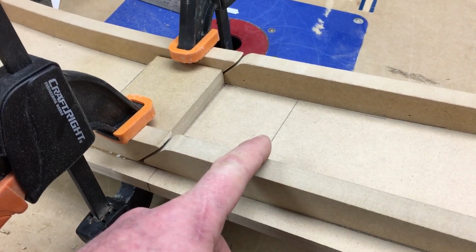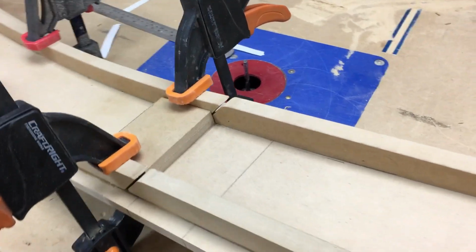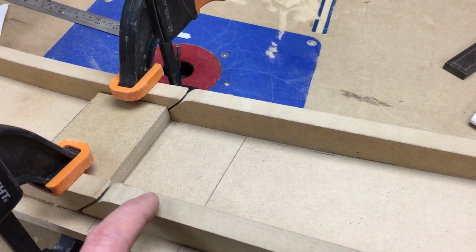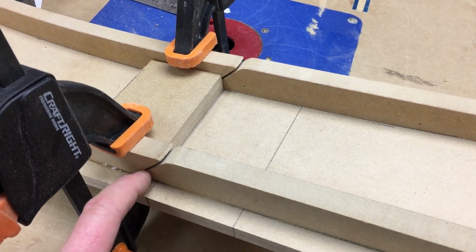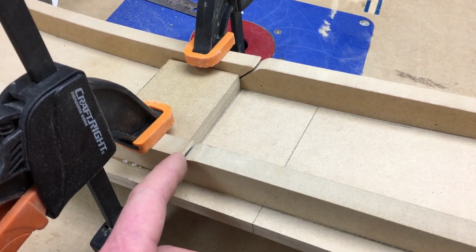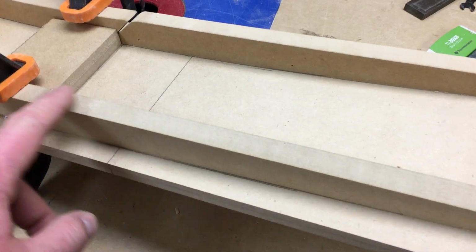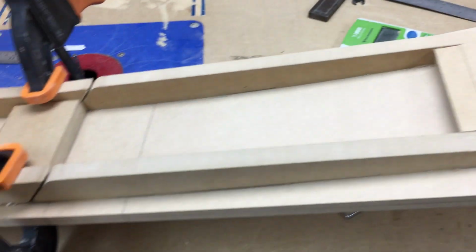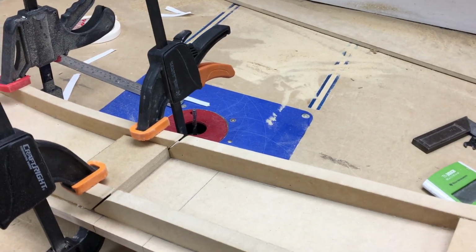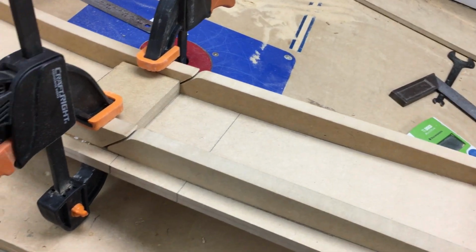This line here is where the two halves are going to be separated, but you'll notice it's not where the ribs separate. And that, again, is for a very good reason. It's because these will actually slide underneath the front half of this curved panel, and with this diagonal cut will actually lock into place. This cut will mesh and that will lock into place so that this front edge can be slid underneath the panel, lock it in, and then the rear edge will drop into the trim panel, and that will be held in place by virtue of the front and the rear both sitting in and meshing with the panels around them. So that'll be easily removable, but also sit in place firmly.